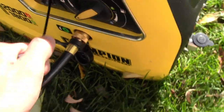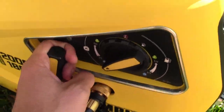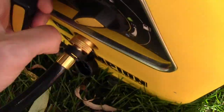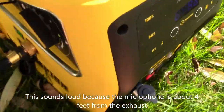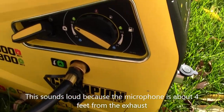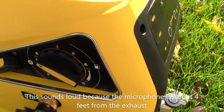So it got fired once. What I found is if you kind of leave it on the propane choke setting until you get a few good pops on it — there, now we'll turn it up to the green. Now it's just in run mode and you're good to go.